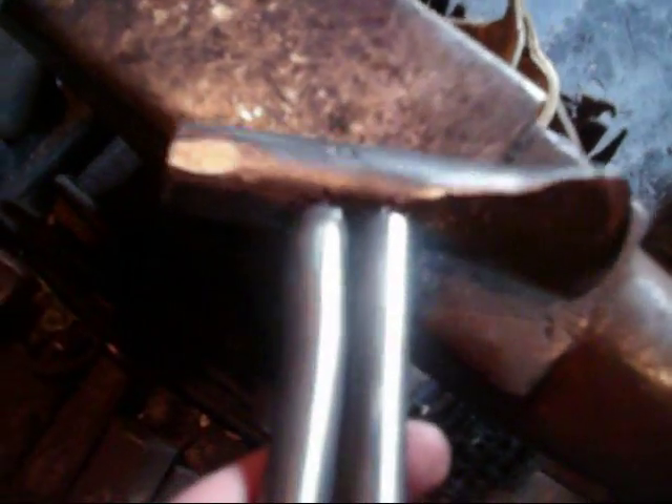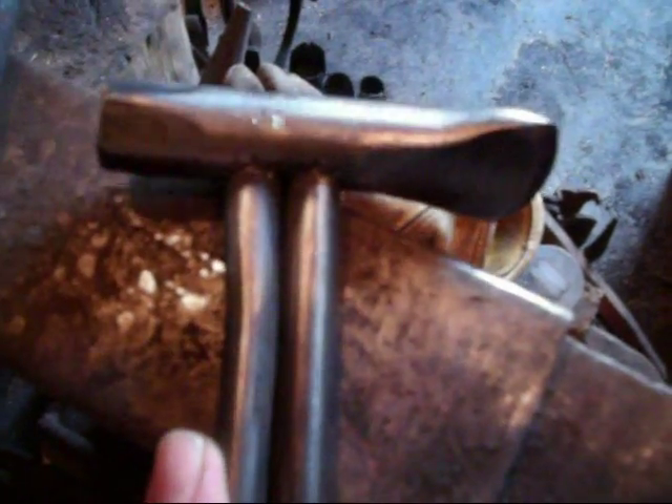Alright everyone, so this is the tool all finished up. I thought you'd have a look at it all finished and wire brushed up. For a little extra security, I took a center punch and punched around the holes to squish a little bit of material around the rods going in. I'll go ahead and show you the one that I based this off of — it's not nearly as well done as that, but I don't think it's going to come off. The head is made out of decent steel. The handle has a little bit of carbon in it, which gave it the spring I needed to squeeze those together to get them in. It turned out pretty good. As far as I know there's no videos on YouTube showing how to do this, and this is my first attempt at it — I think it went pretty well. So anyways, that's my hundred subscriber thank you video. Everybody have a good day, thanks for watching.